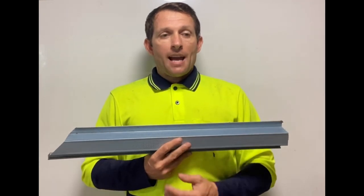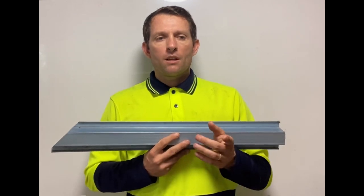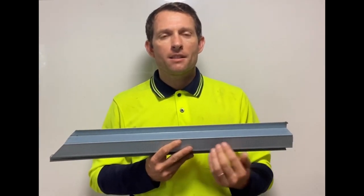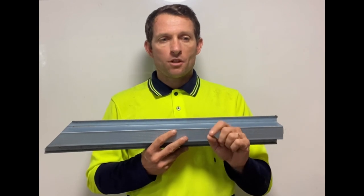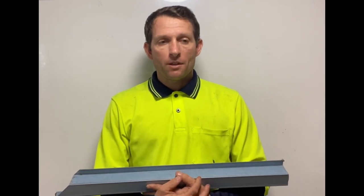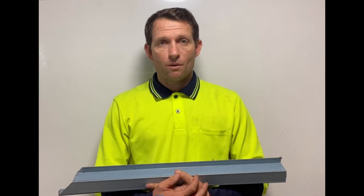If you've got your AS 1562.1 standard there, you can look at clause 1.3.22. It defines any batten, purlin or top hat really as a support member. That's the definition of it first. So they can be either metal or timber, as you'll probably see when you're re-roofing a place. Or people use timber a lot of the time in some states for new houses too.